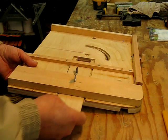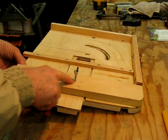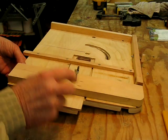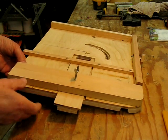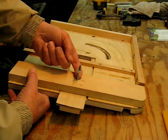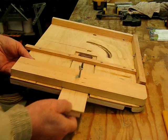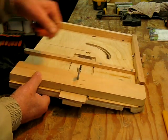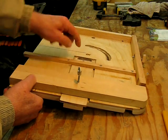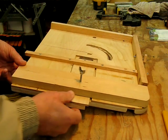At the top end of it, I've incorporated a bolt here in this piece of board and I've epoxied a T-nut just below the surface so it doesn't interfere with the sliding adjustment. Then all I have to do is tighten this up and it holds that in place, so there's no chance of this moving once you measure how big your circle is.